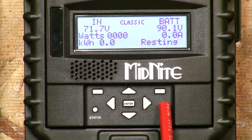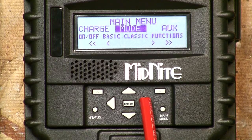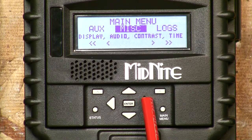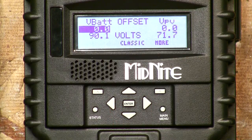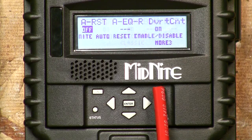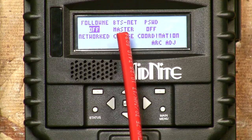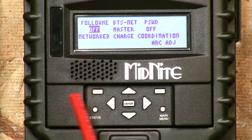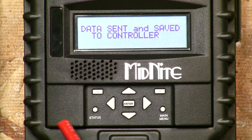What we're going to do is go into the main menu — bottom right button — and scroll until we find Tweaks using the left or right arrow. When we find Tweaks, we'll highlight it and push the middle button labeled Enter to go into Tweaks. We're going to use the upper right button labeled More to go to the last menu and find Follow Me. Here you'll see it's automatically set for BTS Net Master and Follow Me is off. So we're going to turn Follow Me on — that programs that controller — and hit Enter to save that data.